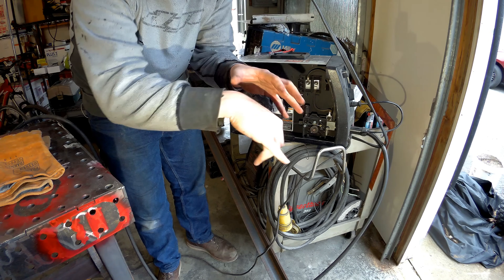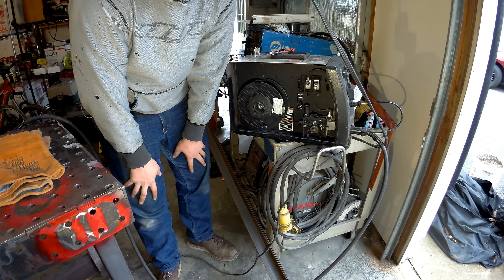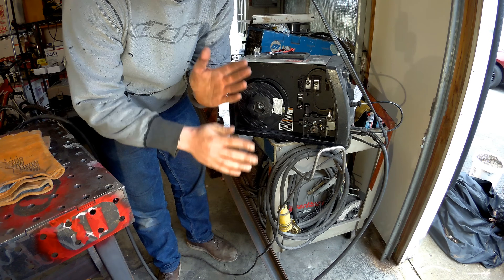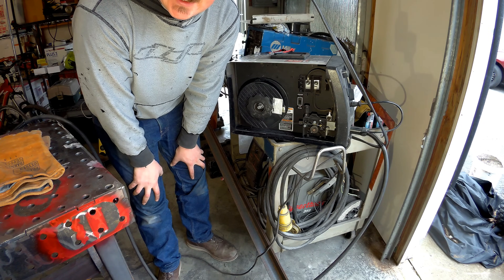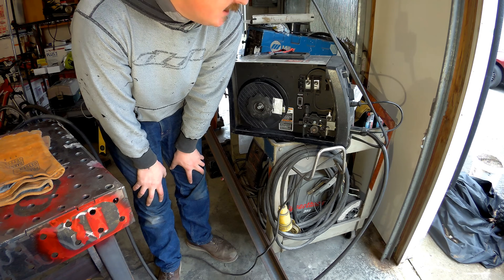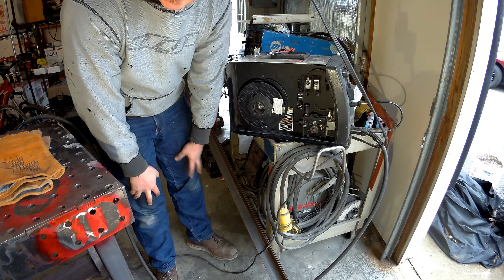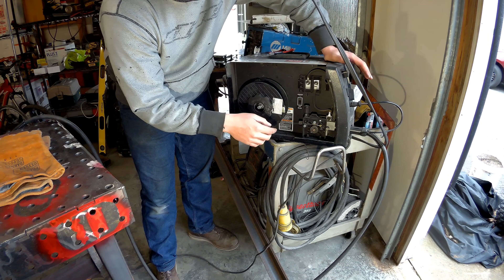The smaller diameter of wire carrying the same amperage or voltage behind it is going to give you more penetration, more heat, and a better weld when it's all said and done. So you're slower with less power, but you'll get a better weld if you use that skinny wire. If you want maximum effect, 030 wire is the way to go — but if you have 220, you can push the 035 just fine, which is what I'm using today.